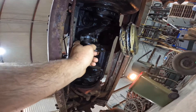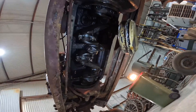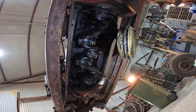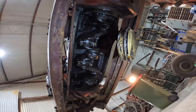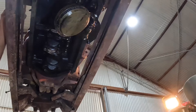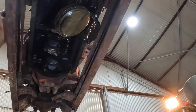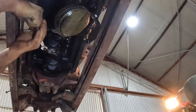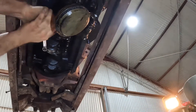We're going to knock these cotter pins out, undo these nuts, and start pulling the pistons out. We tap them out from underneath and push them up to the top. We've just taken the two cotter pins out, and now we're going to loosen off the big end nuts.